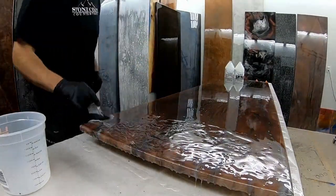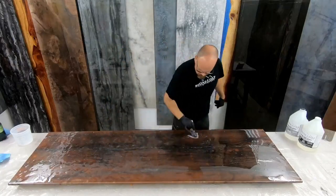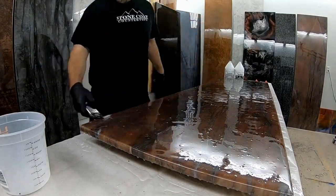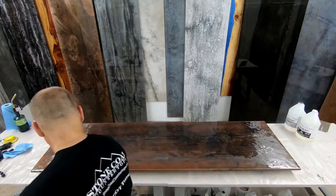Chop that surface again. This is going to remove any trowel lines and ensure that everything is mixed extremely well. Next, we're going to brush our vertical edges out and do this a couple of times, especially to finish up your project so that you get really nice edges.